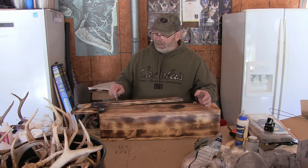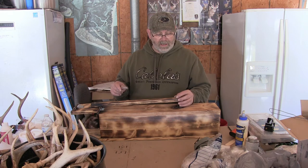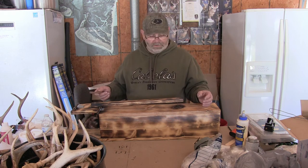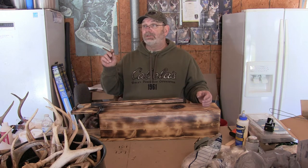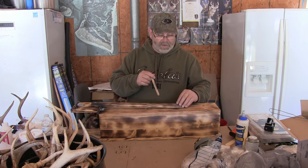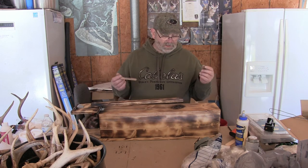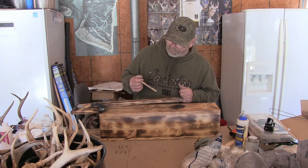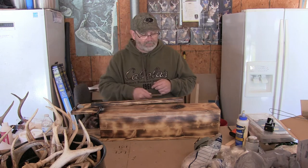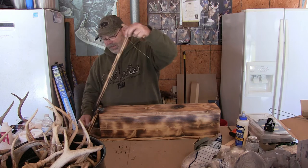This is so long and heavy, for one thing, that it acts as a counterweight to the door. And on one of them, even though there's the same dimensions, evidently the weight was a little bit different. And if this went past here, it wouldn't even trip. So I had to add more weight. So I went ahead and added some more to them both, so they'd both be a little bit more consistent. And plus, it closes a little quicker. So I like that.